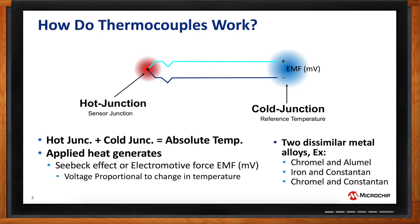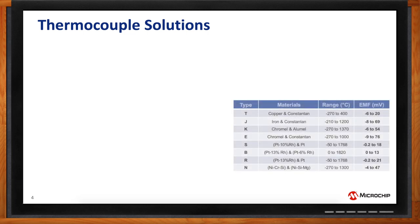So what kind of solutions would you suggest? Thermocouples are available in various types — several materials depending on the temperature range and linear characteristics the application requires. The most common thermocouples are type T, J, and K. Those are just typical names used to identify these different types. The rest are somewhat specialty. You can see the temperature range and how wide the ranges are for each thermocouple, and they provide different linear characteristics for the sweet spots of sensitivity.